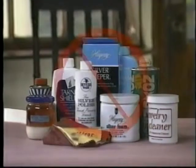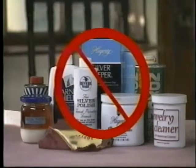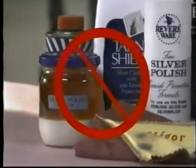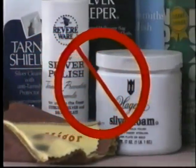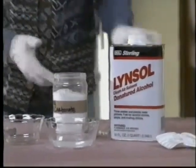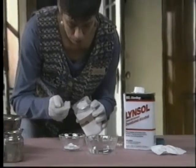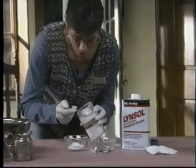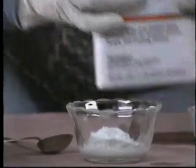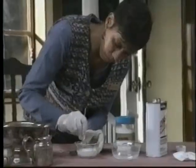Regardless of how stable the object is, commercial polishes should never be used. Many contain corrosive chemicals or harsh abrasives that can permanently damage surfaces. Some contain tarnish inhibitors which have been found to cause long-term damage to metals. The safest and most effective polish is one you'll make yourself. Mix a thin slurry, the consistency of cream, from precipitated calcium carbonate — available at conservation supply stores — and ethanol or denatured alcohol. Do not substitute ground chalk, as it can scratch instead of polish.